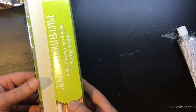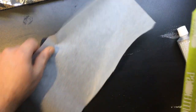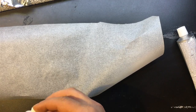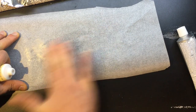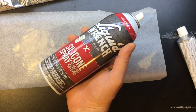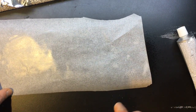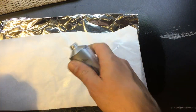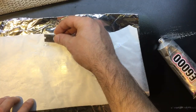It has a nasty habit of seeping through things and gluing itself to whatever's around, so I use parchment paper. You can use wax paper, but you may have to use a couple sheets, maybe on top of aluminum foil. For added non-stickiness, you can use a little bit of petroleum jelly and smooth that around — it'll peel right up off of that. Or you can use silicone spray, although you should probably prefer the petroleum jelly. Also, before you pierce the foil on the tube, wipe a little petroleum jelly on the threads and thread the cap back on, otherwise you are going to weld your cap to the tube and you'll never be able to open it again.